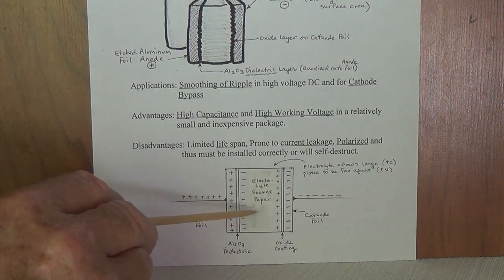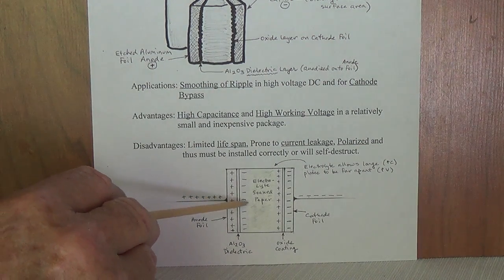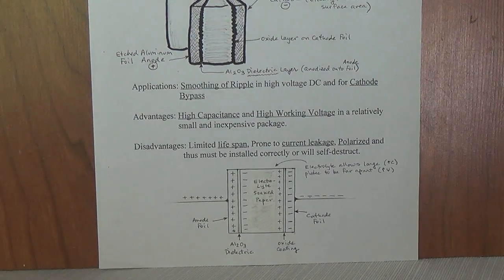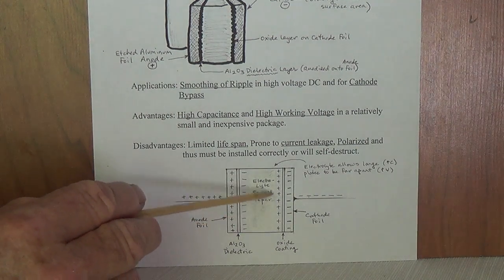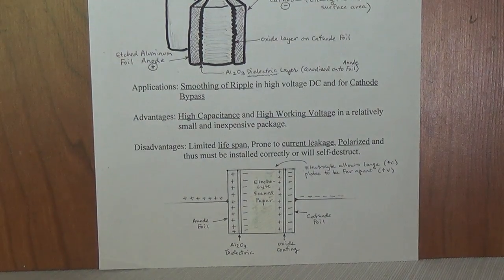If, however, you apply full working voltage to the capacitor, you could end up either with some sort of an arc or some other internal damage to the capacitor, and it could be permanently ruined. Therefore, the slow variac warm-up does have its advantages if your electrolytic capacitors are salvageable at all.